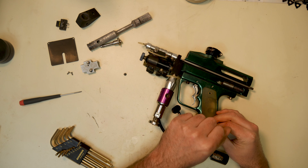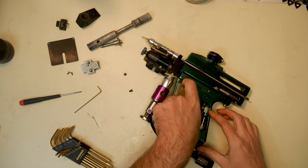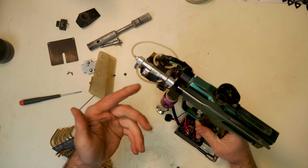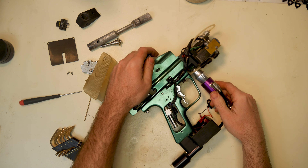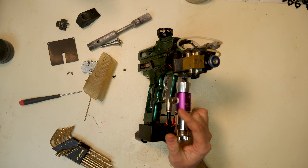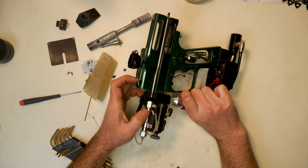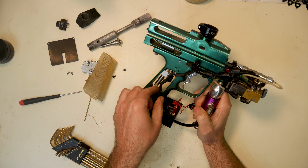The RAM — these are SMC RAMs, or free-flow RAMs would be the normal paintball equivalent to it. They're specced slightly differently, but they're essentially a free-flow RAM. They just have a magnet in them, which is an option to get on an SMC RAM. That's the Japanese pneumatic company, SMC. There are two Mac 44s — older than the Mac 43s you're used to seeing in more modern stuff. One of them controls this RAM, which controls the sear. So it's just a RAM that controls the sear, which is really cool.